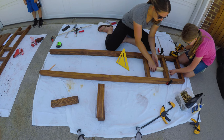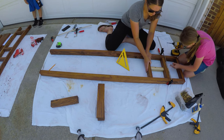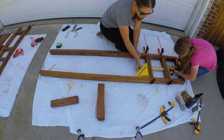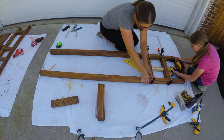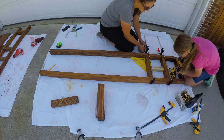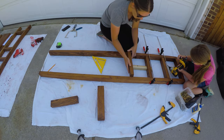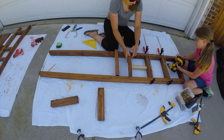The next side piece was again seven and three-eighths inches away from the last board, but this time the pocket holes faced down, away from the previous piece. We installed this piece the same way. The next side piece was installed with the pocket holes facing up towards the last piece, again seven and three-eighths inches away. A shelf will be placed on this piece, so use a pre-drilled piece here.